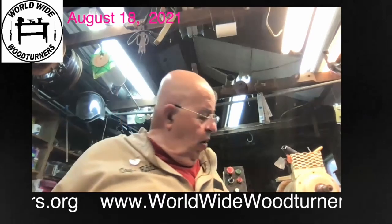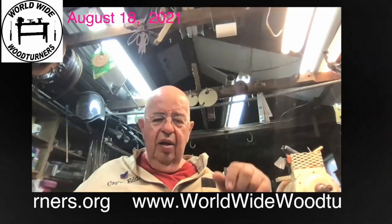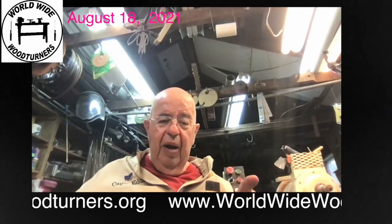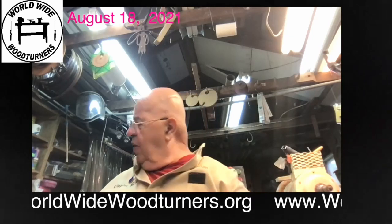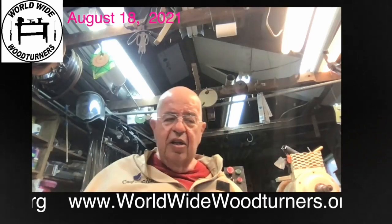Oh, and that's what I would have done to this piece I have here, but I wanted to cut it dry so I could show the piece, and really I had to recut it 3 times and go sharpen my gouge on my third pass because it was coming apart. And if I'd done the CA, I probably would have got around that. I'm looking for the super glue, it's right here in front of me. I'm looking for the wrong color bottle. But I'll use that super thin CA to tighten it up.